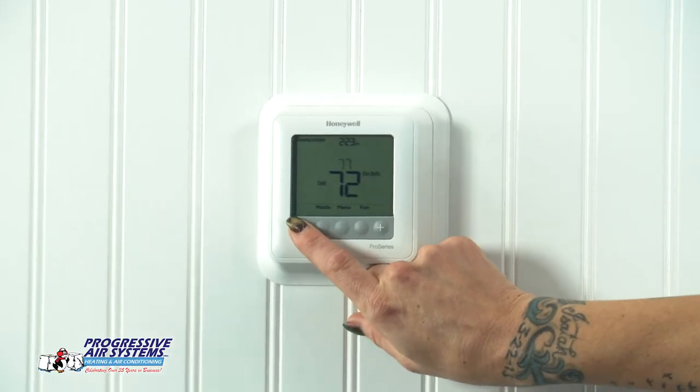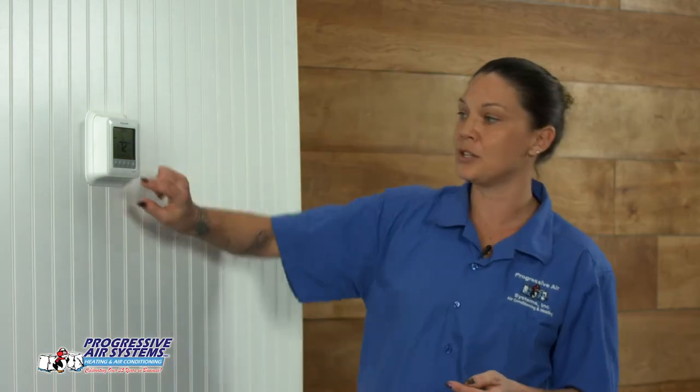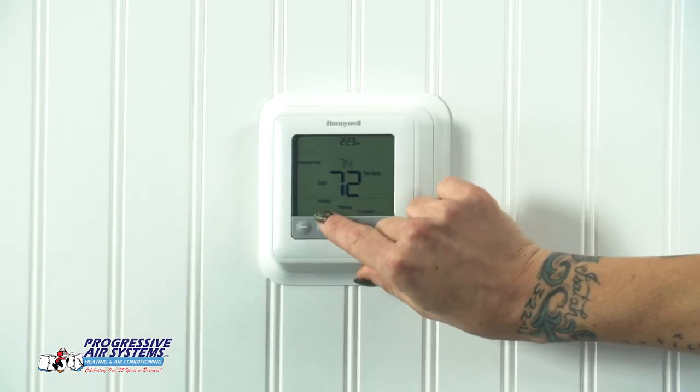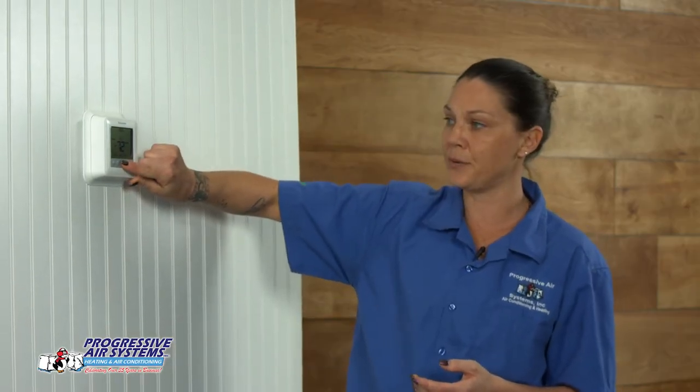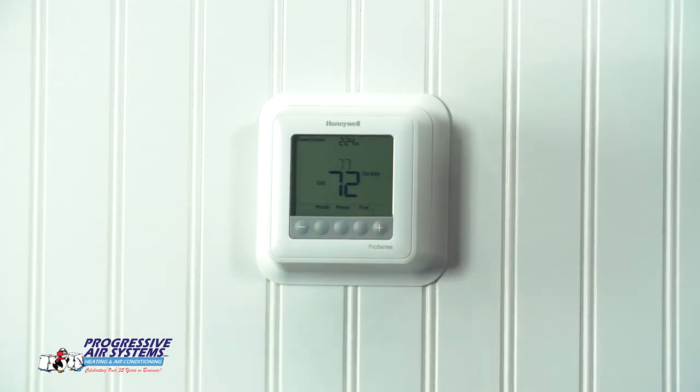If you just get uncomfortable and want to turn it down for a little bit, no problem at all. Go ahead and come up to your thermostat and hit your down temperature. You'll see temporary hold on the left. That means it's going to stay at that temperature temporarily until the next time that your thermostat is programmed to change temperatures, and then it'll override and go to that temperature. If you don't want that and you want it to stay there until you tell it to change, change your temperature, you'll see hold — push that button and it'll say permanent hold on the screen. It'll stay there until you physically go in and change it. Do that by going to menu, you'll see hold — hit cancel and it'll turn off the hold and go back to following schedule.